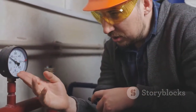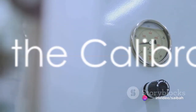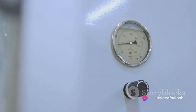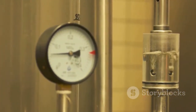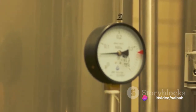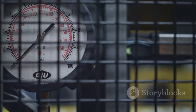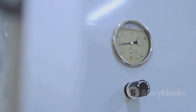And with that, we've successfully calibrated a pressure transmitter. Remember, regular calibration is key to accurate readings and efficient operations. Let's quickly recap the key points: first, isolate and depressurize the pressure transmitter, then connect the calibrator fitting. Apply pressure according to the transmitter range, checking readings at various pressure points. If needed, use the HART communicator for calibration and zero and span trims. After calibration, remove the calibrator, flush the line, and reinstate the valves. Finally, ensure the transmitter is reading correctly and document the readings. Keep these steps in mind and you'll ensure accurate readings and efficient operations every time.